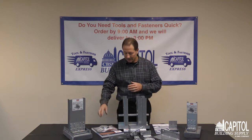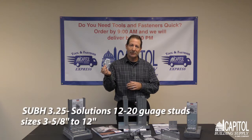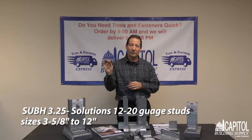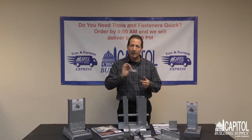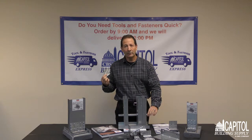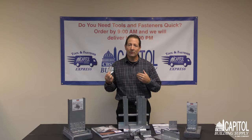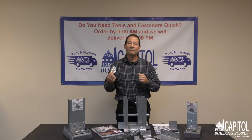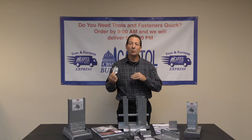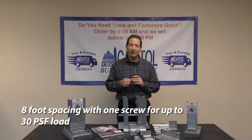Simpson Strong-Tie has come up with a product. SUBH stands for Structural U-Channel Bridging, 3.25, 3¼ inches. It's simple to install. The cold rolled channel is going to go through your studs. Simpson Strong-Tie has done testing for most of your load requirements that can be spaced up to 8 feet. No other bridging option can be spaced up to 8 feet.